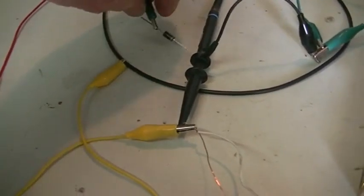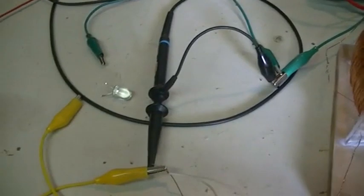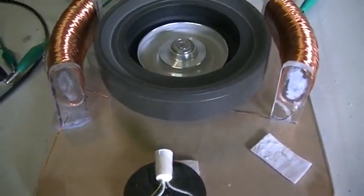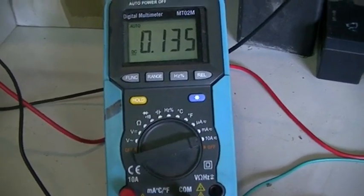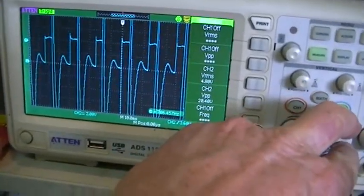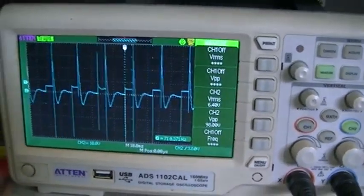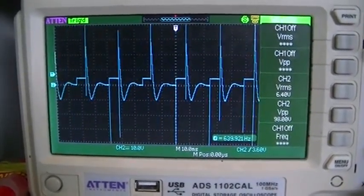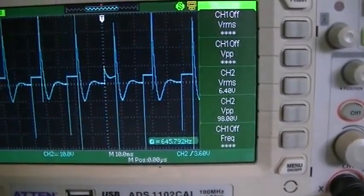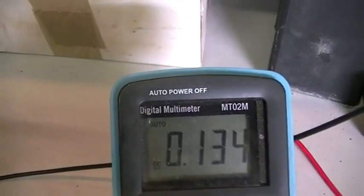What we'll do is leave the coils open for the time being and see what happens. I am seeing a slight current reduction, and you can see very large inductive kickback spikes all over the joint now. We have ten volts per division — that's 98 volts peak to peak.